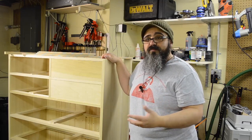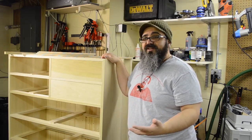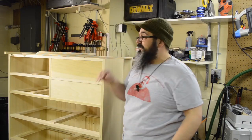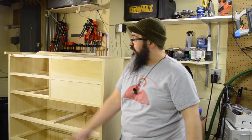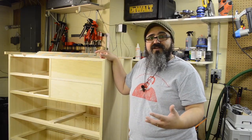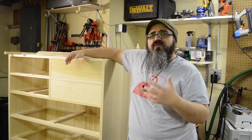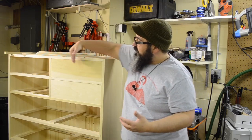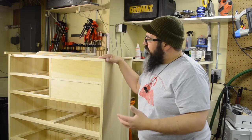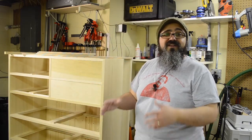You could get around that completely by just skipping the drawer glide and having the boxes be inset. Or you could do like I did and just make it so that these two drawers only fit in this spot and those two drawers only fit in that spot — while the larger ones are interchangeable, those ones are not. Considering this dresser is going to be painted, I'm not too worried about it since there's no grain continuity to maintain. I should mention that the drawer glides for the larger ones are actually perfectly centered since there's no center divider, so those could potentially be a lot more interchangeable.